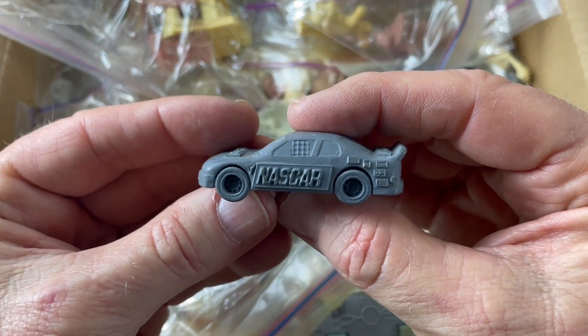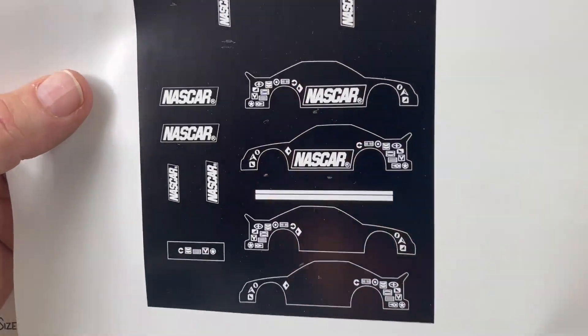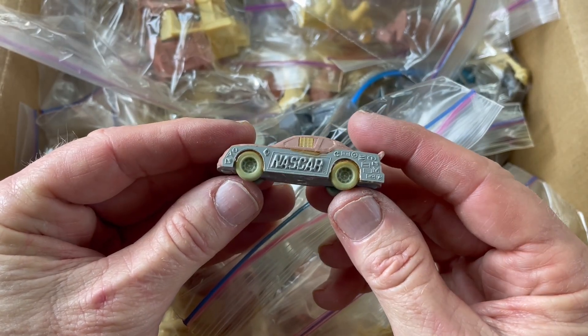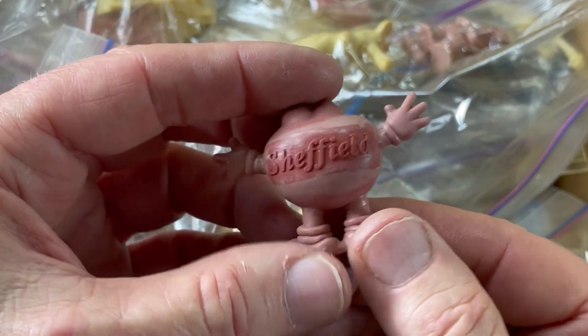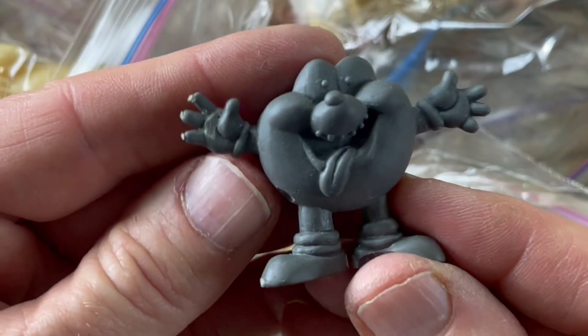Because these were promotional items, I did a ton of erasers with corporate logos on them. I would do the logos as vector art and then send it to a service bureau to etch on aluminum plates. From those, I had to make a silicone mold, and then I'd cast the logo in a really thin sheet of urethane resin. But soon I brought the whole process in-house and machined the logos on a three-axis mill. It required a workstation-class computer, industrial grade software, and a three-axis mill — and combined, those things cost more than $25,000. Anything digital back in those days was heartbreakingly expensive.